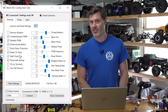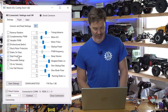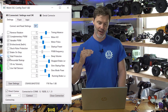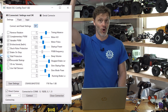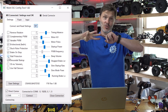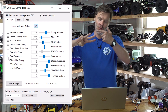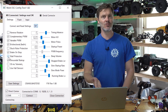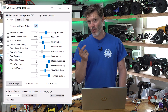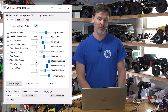Brake on Stop is essentially drag brake. If you want drag brake when you're sitting on a hill, then you want that enabled. Stall Protection sits in between your sinusoidal startup range and your normal sensorless PWM mode. It protects your motor's speed from dipping down too low and gives a little more consistency in that low throttle range. My personal preference is to keep stall protection on, but if you want more throttle feedback, you may try having it off.